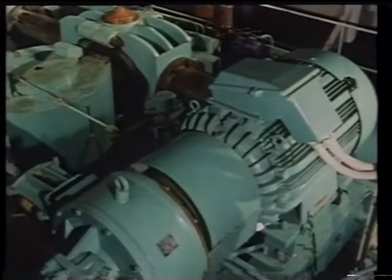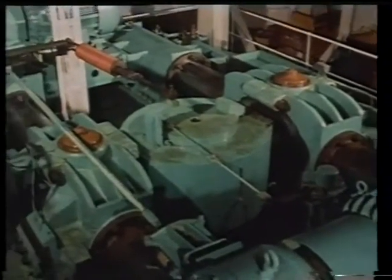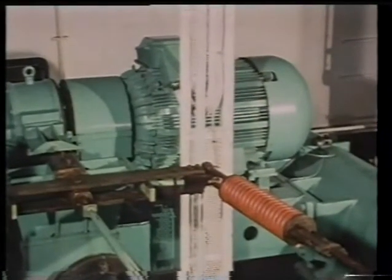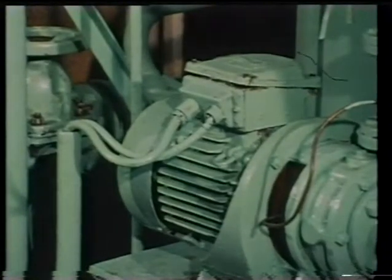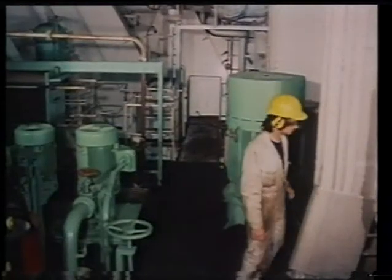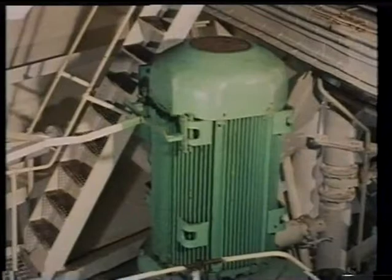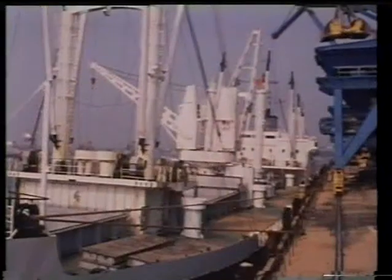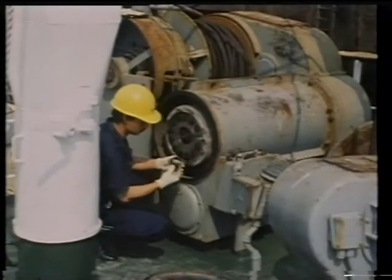The most commonly used electric motors on board ships are the 3-phase squirrel cage rotor induction types with star or delta connected stator windings. These motors function in widely varying atmospheric conditions, and they are totally enclosed fan ventilated or enclosed ventilated drip proof and explosion protected types. On deck machinery, they may be in a watertight enclosure.